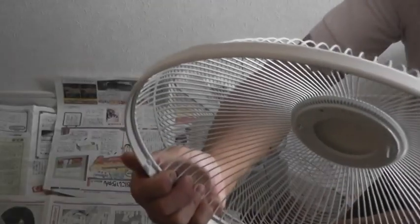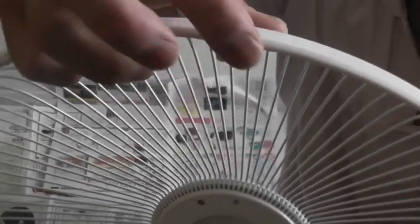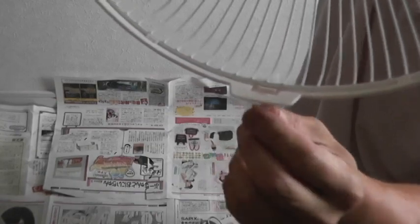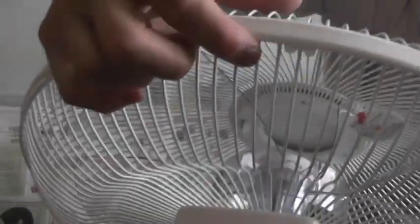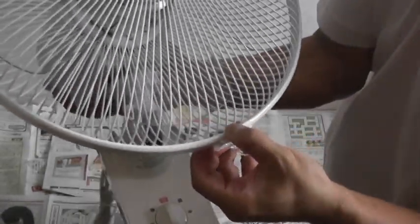And you're going to take your fan. So I'm holding it so that you can see. And do you see the groove? There's a little groove at the top. So here's a little groove. So this is the top, and here's a little plastic thing at the bottom. You're going to take your fan and you're gonna put it on like so onto one of these little ribs. Like so, and then you're going to go around and push the cover into position. You're going to hear a snap.